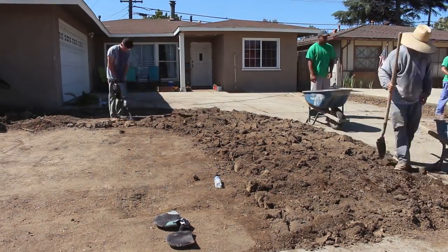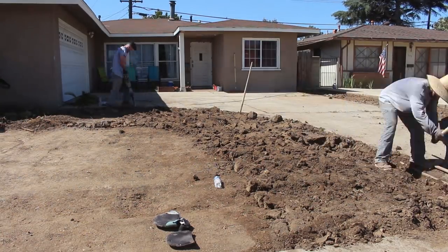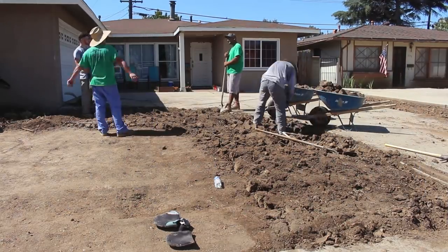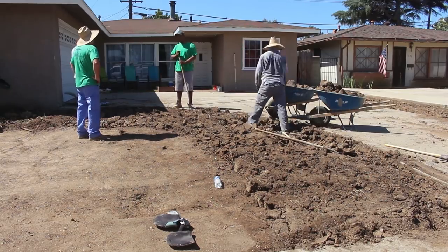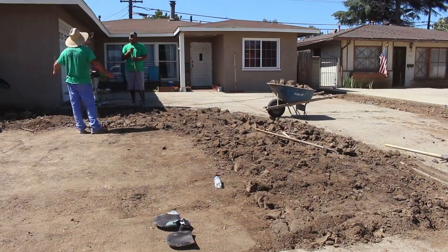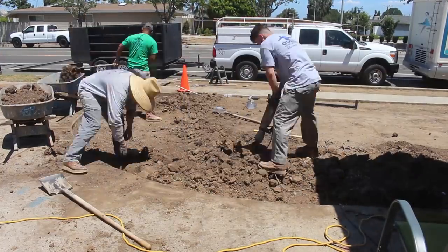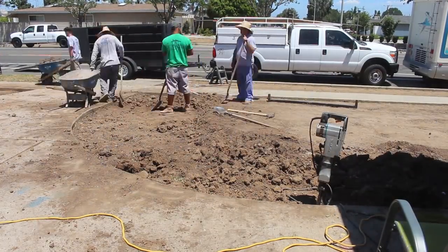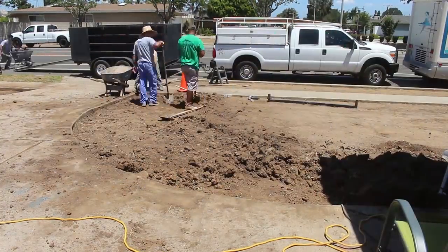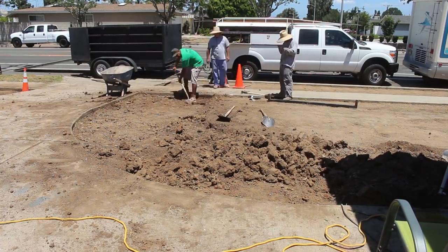We're going to be doing a lawn also along this side of the driveway here. We're going to do a tile red color around the perimeter of both add-ons to the driveway. We're going to do a wet tool joint on the curbs. And then we're going to do a dust-on tile red around the perimeter, being careful not to get into the field. Now that red border 6-inch trim we're going to do on this driveway area is going to continue around the entire lawn area as well for the mow strip.